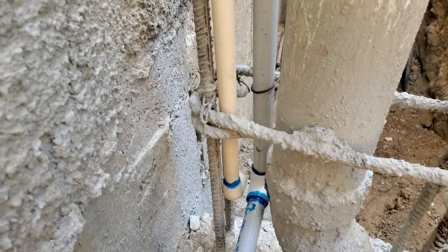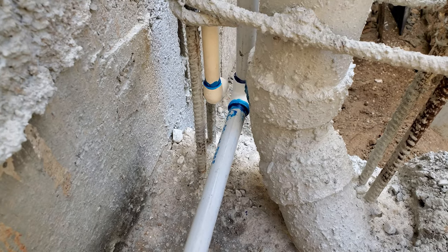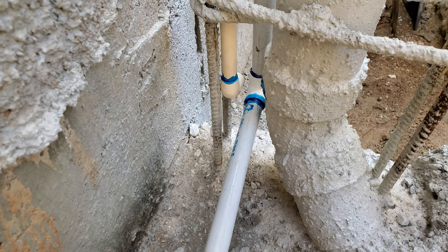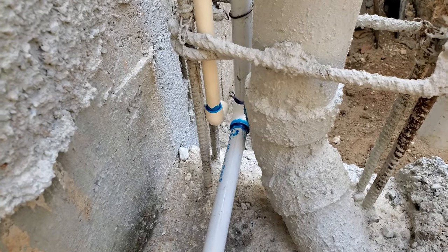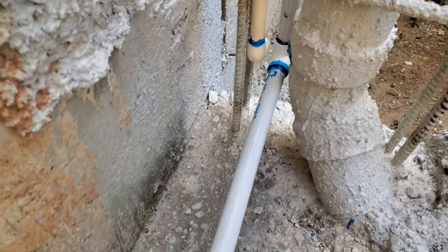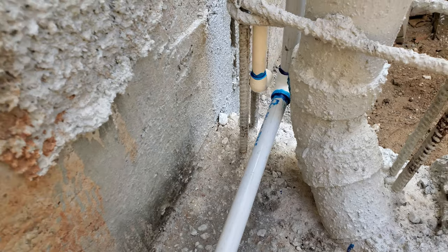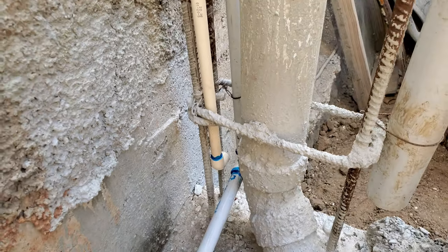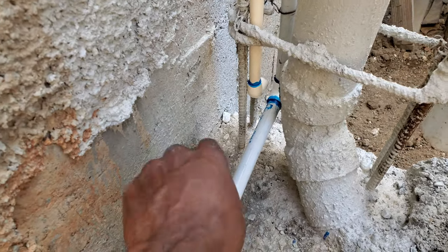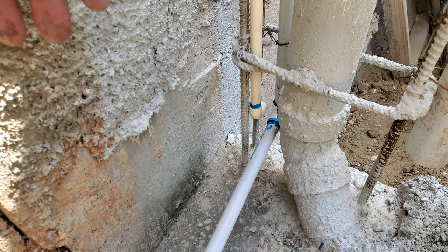This now is the cold water pipe, half inch pipe. I considered using a bigger pipe, but I figure it makes no sense, because water always goes over here. So the tank is up on the roof, and I'm going to lead the bigger pipe from the tank into the bathroom upstairs. Now I'm going to put a stop valve right here, so you can lock off and turn on the whole upstairs, and then put another stop valve upstairs to lock off and turn on the tank. So if the tank overflows, come down here and lock it off. If you want to maintain or fix the tank, you go upstairs and lock off the tank alone.